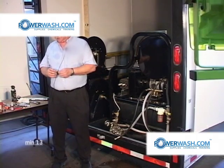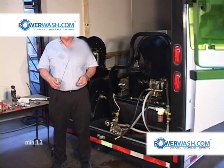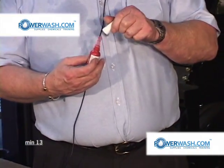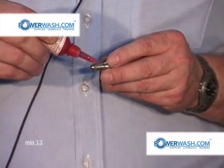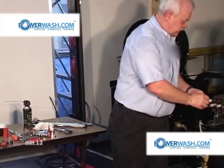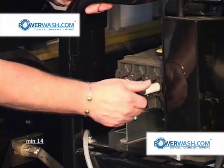Now we're going to replace the plunger, with the plunger bolt having been cleaned and the thread surface inside the rod having been cleaned. First thing we're going to do is apply Loctite 271 — again, that's Loctite 271. Do not use anything else. You do not use copious amounts of this either; just a drop or two will do it. If you get too much on there, it'll stick to the plunger and weld that plunger onto that piston, and the next time you have to remove it, you'll have to break it to get it off. Then just insert the bolt back in the plunger, roll it up there, and tighten it finger tight.